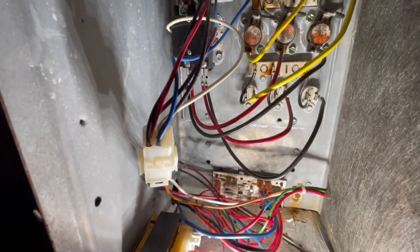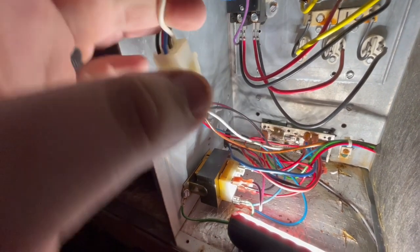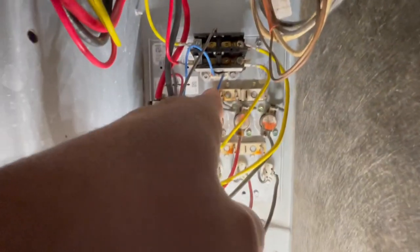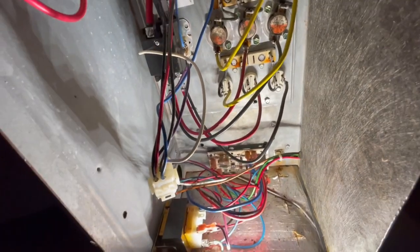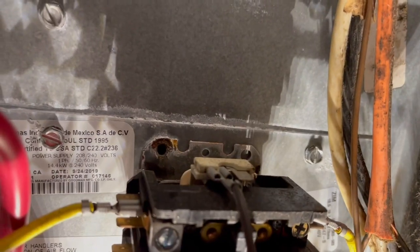This contactor gets its voltage first — that's where it gets the hot, and then it grabs the common from the top contactor. I had to move the plate that holds the breakers to get to that top screw because it was kind of cockeyed, but this will be a real easy replacement. We had no heat last night — it was blowing cold.